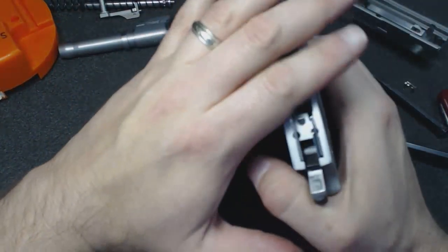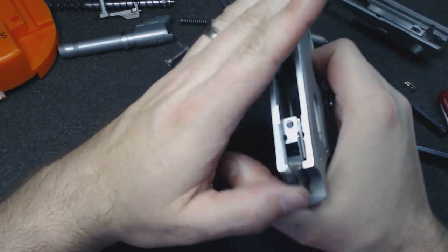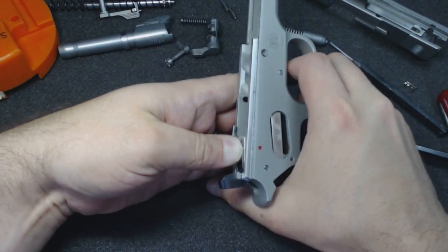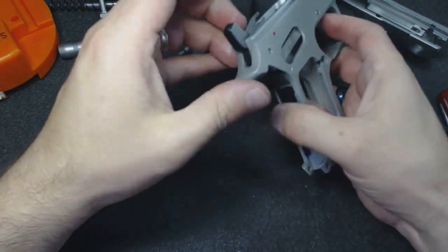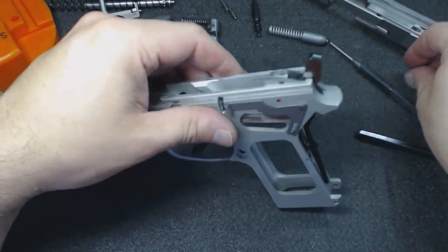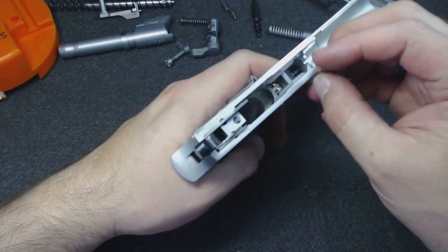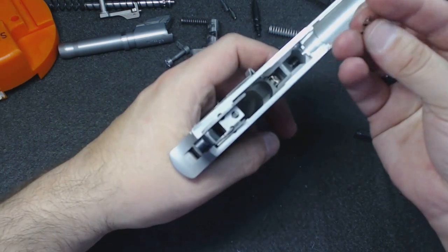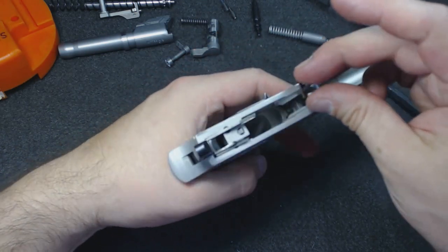So that's our single action and our double action is working as well. Again, firing pin safety is coming up, and if either of those comes down, that's a trigger disconnect. Feels like everybody's working even without the mystery piece. And looking at the mystery piece, I'm just stumped.